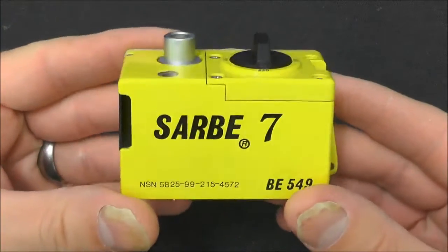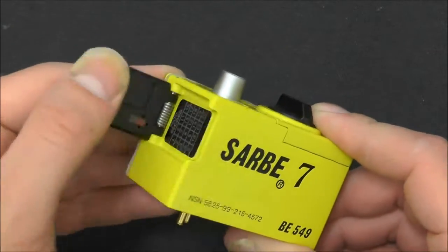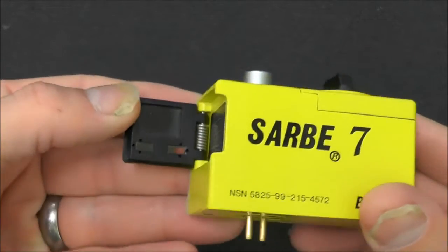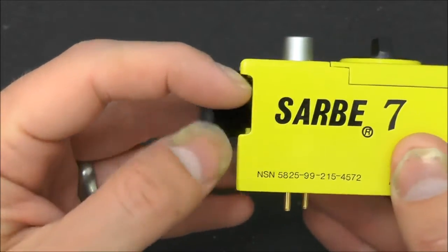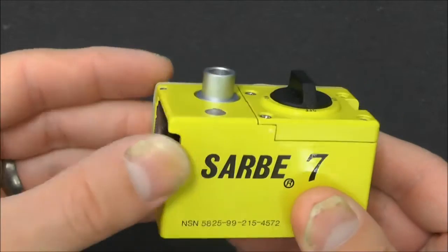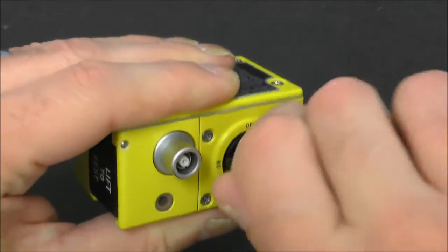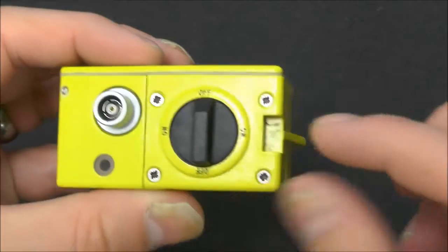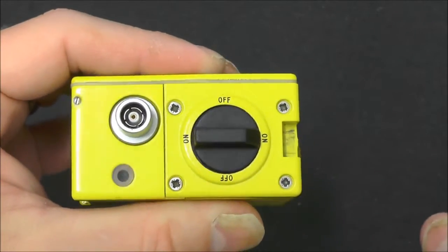Taking a proper look at this, it's a cast aluminium box with a window door here — lift to test. There are no apparent switches visible there, though there are two bits here which I suspect are magnets, and there's possibly a reed relay inside to detect when that door is open. There's an on-off switch here which turns all the way around, and given that there's a slot here, I suspect there would be something you can pull to spin the switch to on and activate the unit.